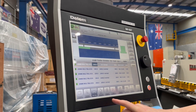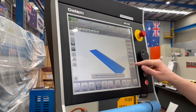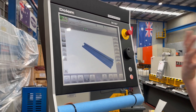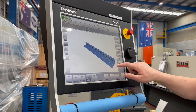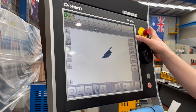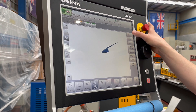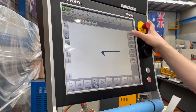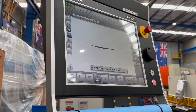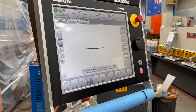Once I'm happy with all my tooling, I move across to the bend sequence. Once I'm set on this screen, I can just create a bend sequence — it'll search for and calculate the full bend sequence. I just need to unbend it, and once I do that it will give us our blank size. So that's the blank size we need to cut so that when we bend everything, it comes out to the correct dimensions.